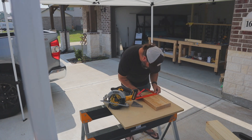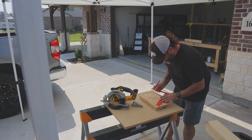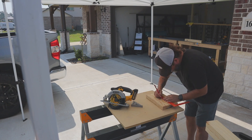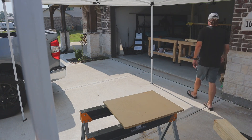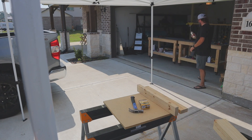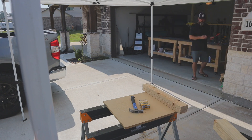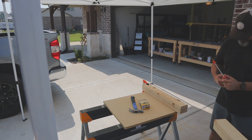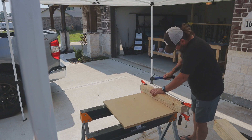It makes a big difference. Obviously you don't want the wing spar sagging. I noticed when I was hanging the skins that making fine adjustments to the height of these supports in the middle made a big difference in the ease or difficulty of hanging the skins to keep all of those holes in alignment. Simple project — just a little bit of wood glue, clamped together, nailed, then run inside to the belt sander to get those two ends nice and clean and flush.